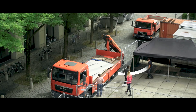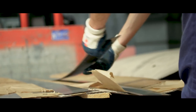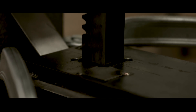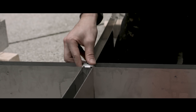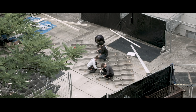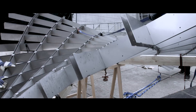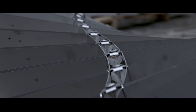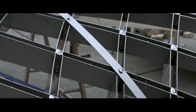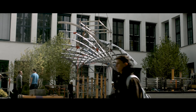The lamellas are cut straight and flat and can be easily manufactured and transported. The construction itself relies on very simple processes: the lamellas are slotted together by hand into flat segments, then elastically bent into their curved geometry. By fixing every node to 90 degrees and adding some edge supports, we can freeze this shape.